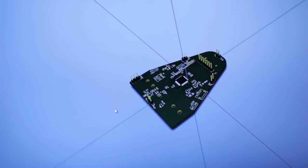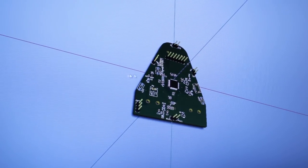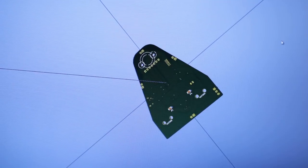The design is done — that's step one. I'm going to send this off to a PCB manufacturer, and we should get it back in maybe a week or so. One of the things I like to do after finishing is load it up in KiCad's 3D Viewer mode, which lets you view the PCB in 3D. This lets me know if some components are going to be weird to install or if things are going to bump into each other. It gives you another viewpoint of what the board could look like when it's finished. And that's part one done.